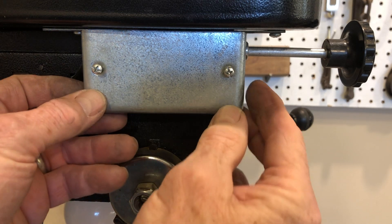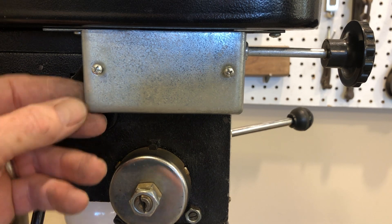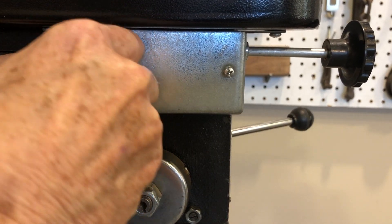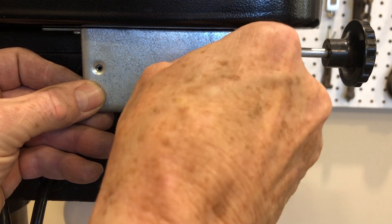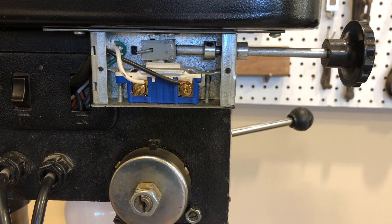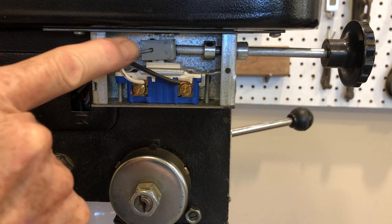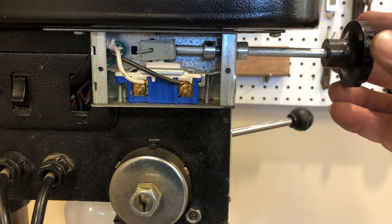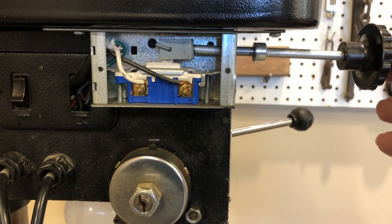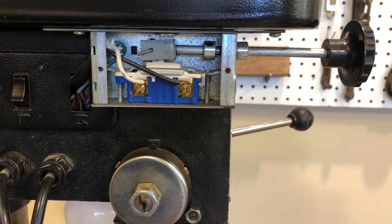This is the switch I made for this drill press. I used a shallow outlet box and put a little cover on it. I had to cut the top of the cover off so it would fit flush to the drill press. Inside is just a standard on-off switch. I created a yoke that I attached to the shaft that allows me to operate the switch. It turned out to be a huge upgrade — it's a lot easier to operate the on-off switch on this drill press.